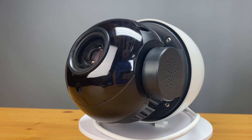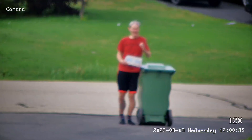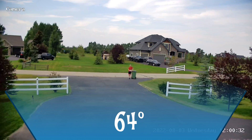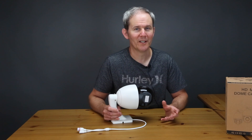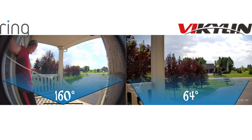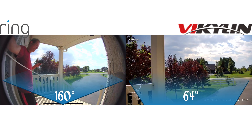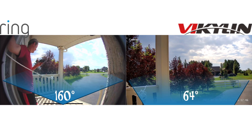Let's talk about that 20x optical zoom lens. It has a focal length range from 4.7 millimeters at its widest up to 94 millimeters, translating to a viewing angle of 64 degrees down to 2.9 degrees. Keep this in mind when selecting your install location — 64 degrees is not very wide in a tight space. This is a zoom camera suitable for open spaces like parking lots, farms, acreages, warehouses, and businesses where you need to zoom in to capture details at a distance.